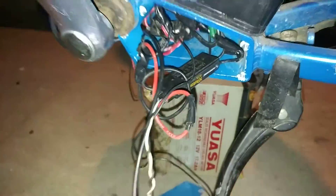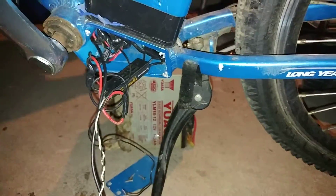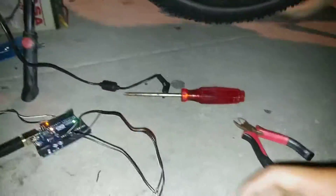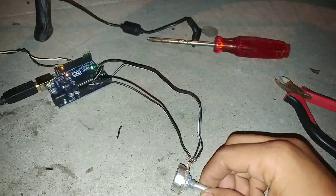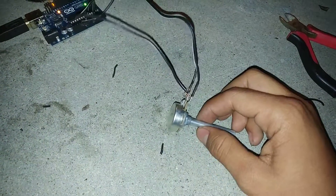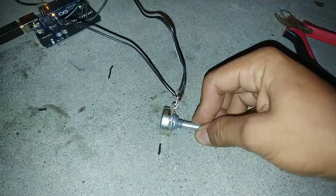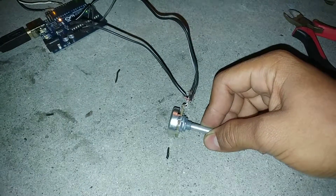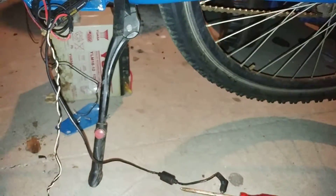As you can hear right now, the motor is kind of humming. That's because my electronic speed controller runs backwards and forwards. So right now I'm trying to zero it out with a code. That's a 100% zero. But when I go a little bit back — like the max zero for the potentiometer — I go backwards a bit. And it's annoying because I can't start up the motor like that.